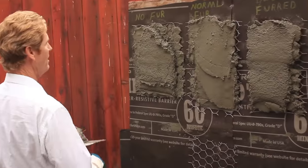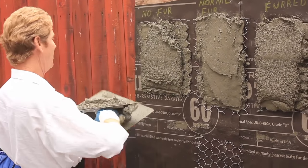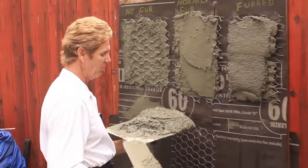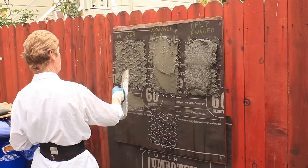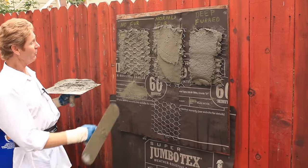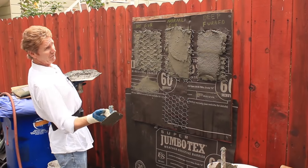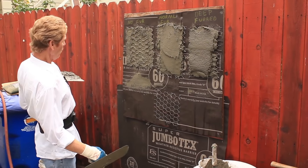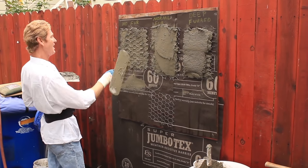Now this flat wire here — normally if I wanted to adhere I'd push here and here. It's already got an inch and a half. That's the point I was trying to make, guys. Because you don't want it too flat. Otherwise you'll be working a whole wall and all of a sudden you'll hear it fall right behind you. I've done houses where guys are putting it on and you can hear the stucco falling all over the house. The wire's too flat — that's the important thing.